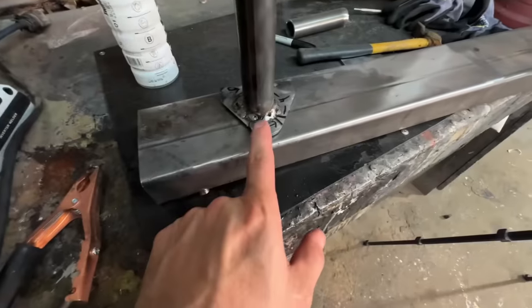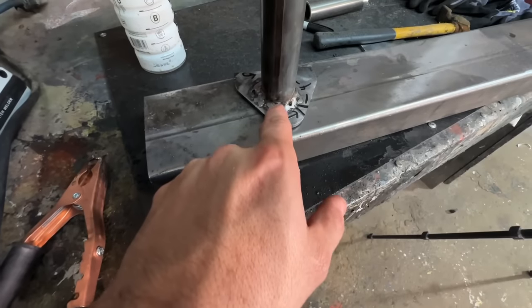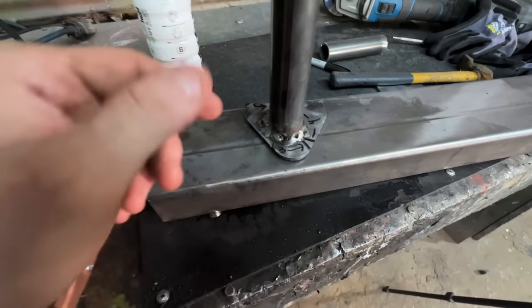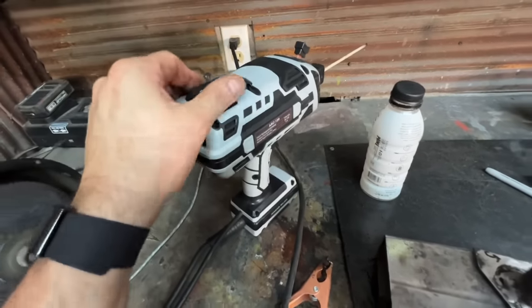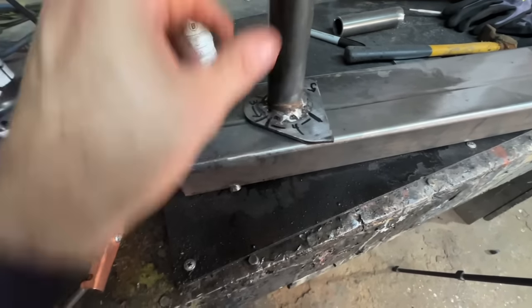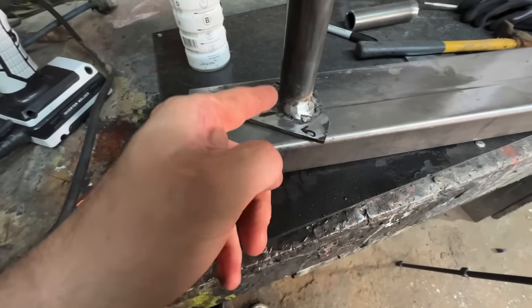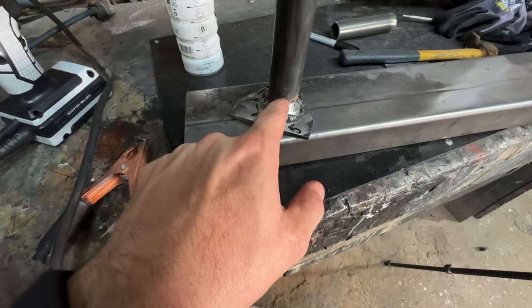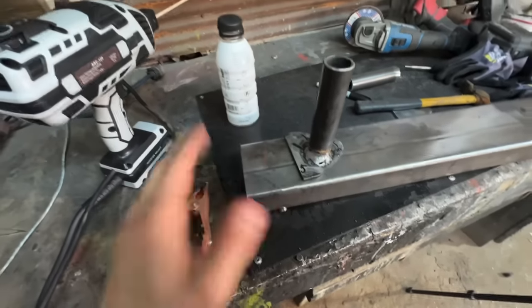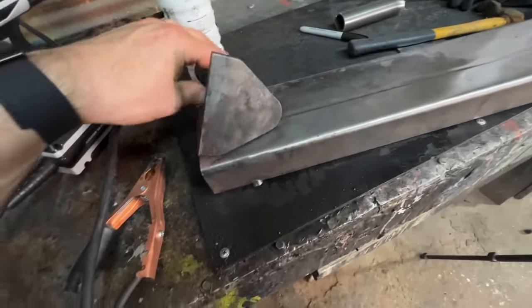Okay, we were playing with the settings. I tried to keep each setting on its own little spot on the bracket — didn't work out great. Setting three gave me almost no weld at all, I had to push half a rod in there to get these ugly little tacks. Setting four seemed worse than three, which doesn't even make sense. Setting five was actually welding fine. I re-welded this three or four times just trying to get my angle better. That's a solid weld — it looks awful right now but I'm not going for pretty yet. Stick welds are never pretty anyway, at least mine aren't.